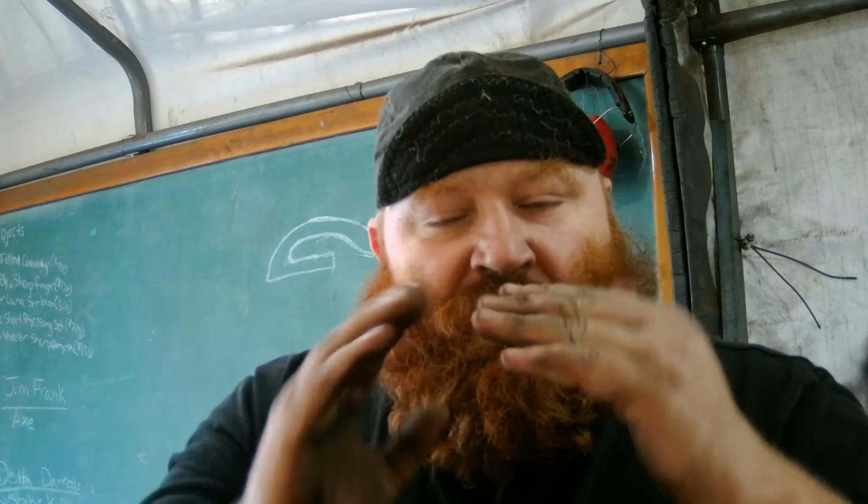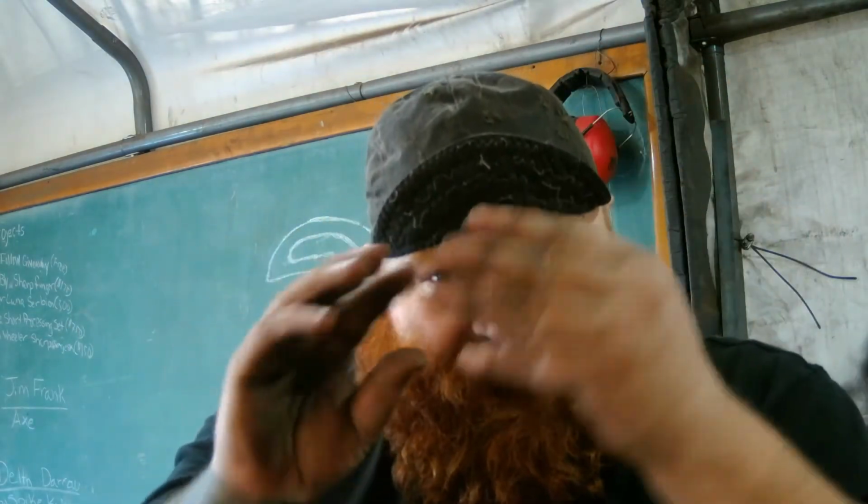Okay, here's the steps we're going to be doing. We're going to be bending through our hardy hole, or a vise. We're going to use the hardy hole. Bending, quenching and upsetting, and this second stage we're going to repeat until we get a nice small soft inner bend and small soft outer bend, right? And then we're going to go into, and we would have upset all this. So that's upsetting it into that small corner and compacting it.